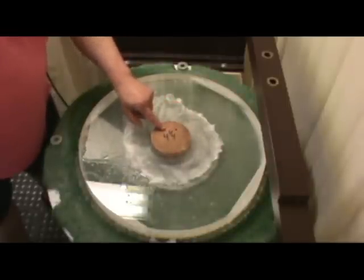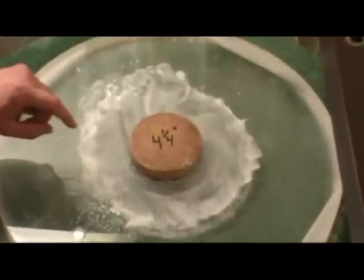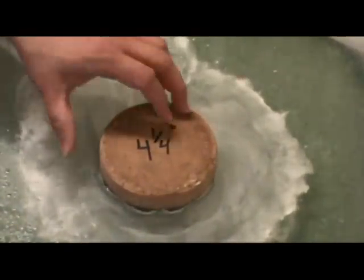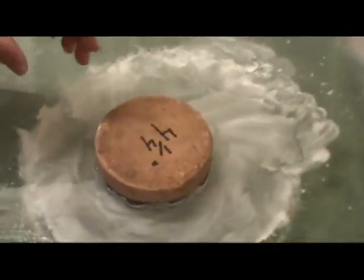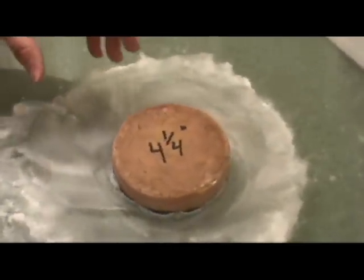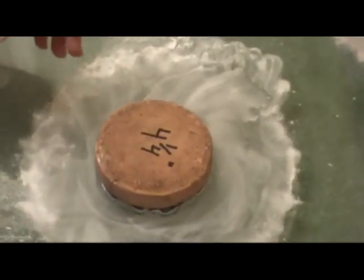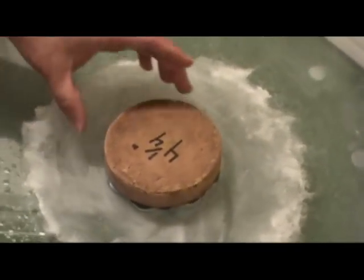To do that I'm going to use this little 4 and one-quarter inch pitch lap. Now when I do corrections like this for figuring, I like to use a variety of strokes that I'll demonstrate. By using a variety of different strokes all moving toward that target, you tend to leave a little smoother surface and broaden the action out a little bit.